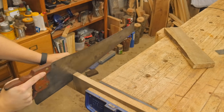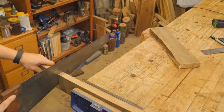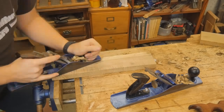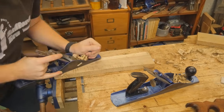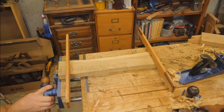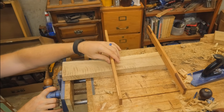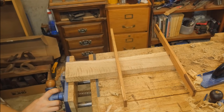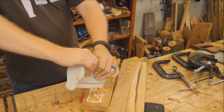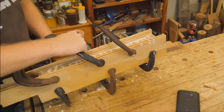After cutting them apart I need to surface off the sides so that they mate together well - basically I just need to make one side of both of them perfectly flat. To make sure that they are flat I use winding sticks. I love using these things, they're kind of fun and one of the first tools I ever made, but they allow you to tell exactly what needs to be smoothed out. Once I have two joining sides perfectly flat and ready to mate together I can glue them up and then clamp the snot out of them.